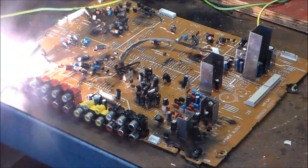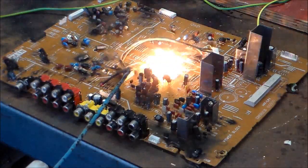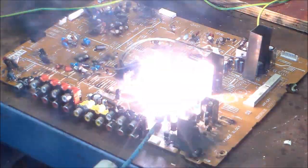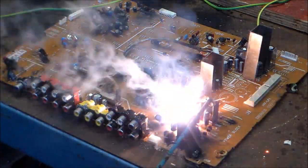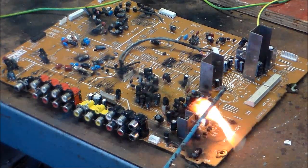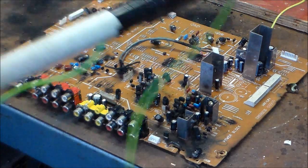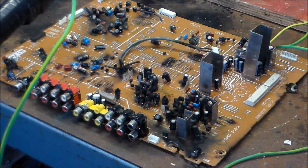You can see I could run this for a lot longer than before, simply because I'm using a resonant circuit to draw more current through the transformer and not get all busted up on the primary side, because I'm limiting it with a ballast.